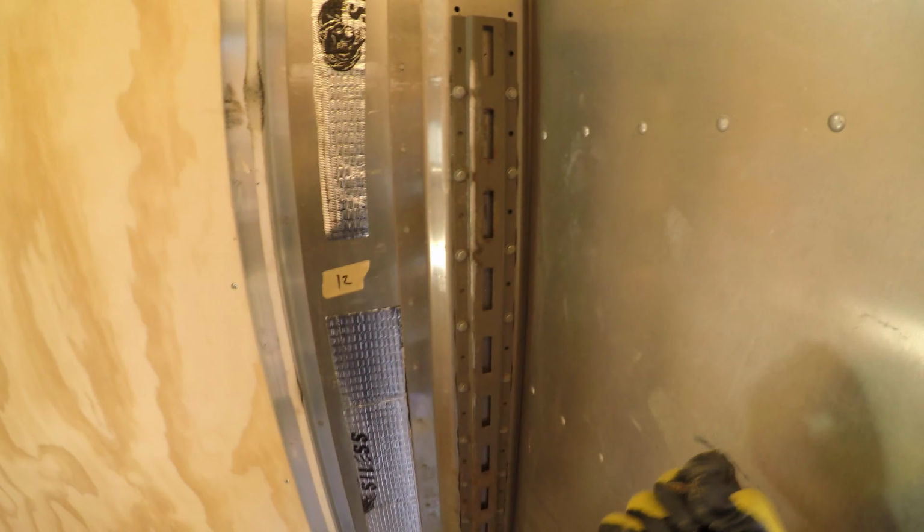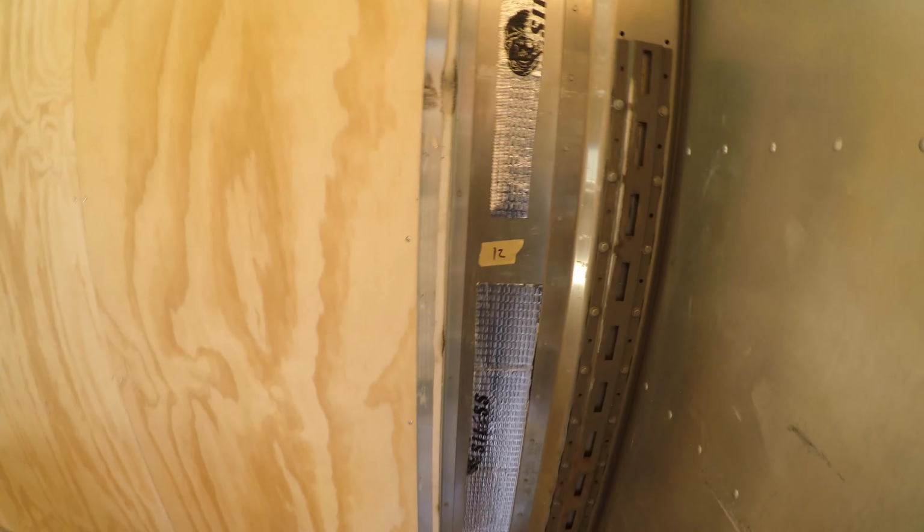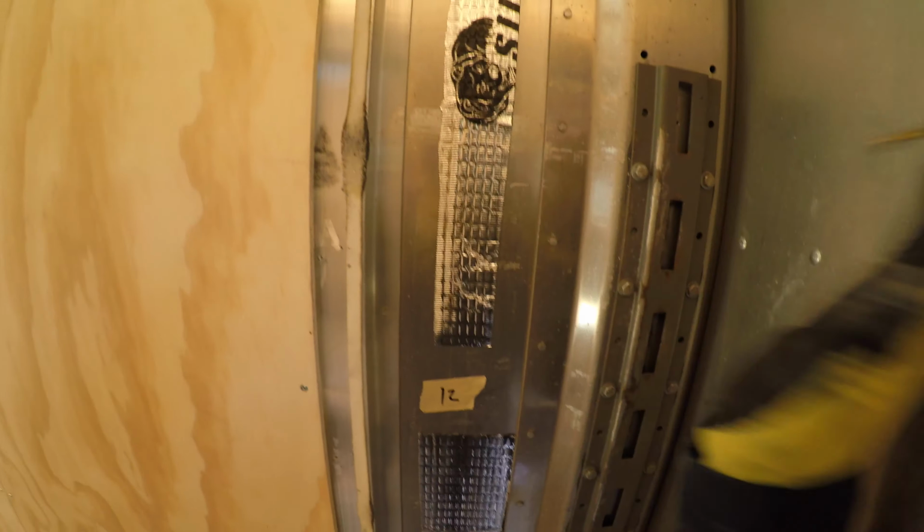And now you have a small window once you do this, but once you color the tip of all the screws, I'm going to place the board on here and press it down, and what will happen is the permanent marker will mark on the board exactly where I need to screw. Once I do that, I can drill the holes in the wood, put the screws in, and they should line up properly. So let's see if it works.